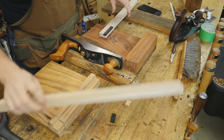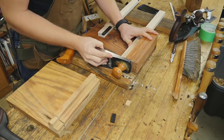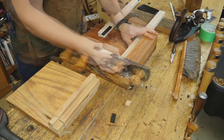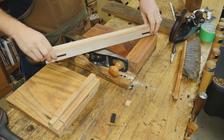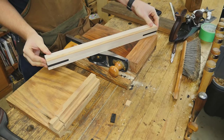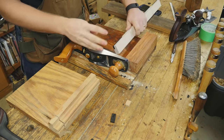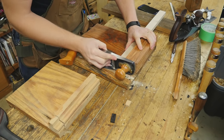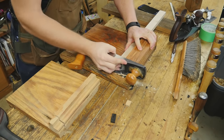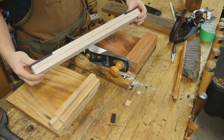I put this on the shooting board and clean up the end. I've got a good bit of work to do on this piece. Now I've got a really nice clean edge all the way across. I set them on here, line them up, find out which one is a little longer — and by George, they're actually the exact same length. All I'm going to do now is cut these two off and trim up the other end so they're nice and flush. And that one is just a little longer, so I'm going to shoot it down until they're exactly the right length.